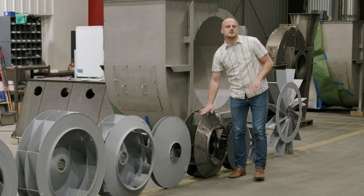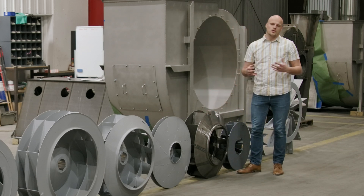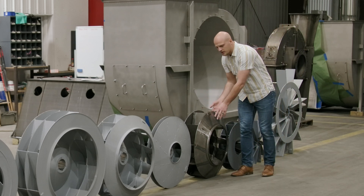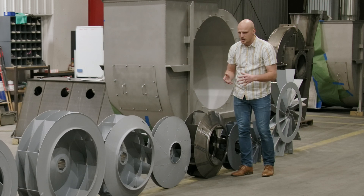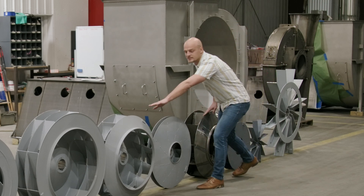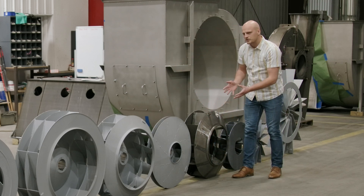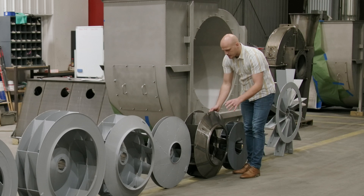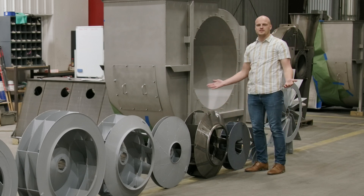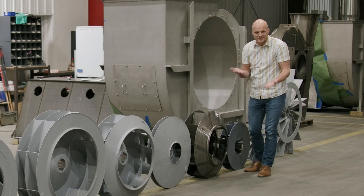This one is an industrial exhaust air handler — you'd choose a wheel like this when you're dealing with particulates in the gas stream. It has a backward inclined blade, so it does a decent job with efficiency. Along with the RTHS wheel, these are more middle-ground products that can handle some material in the gas stream while doing it more efficiently. This unit is probably doing somewhere around 10,000 CFM at 35 inches of static pressure.